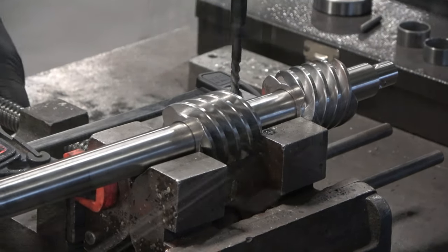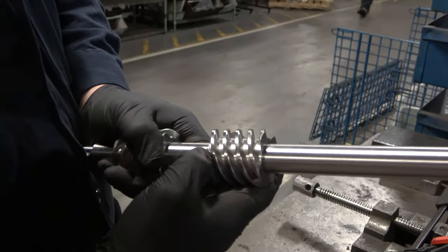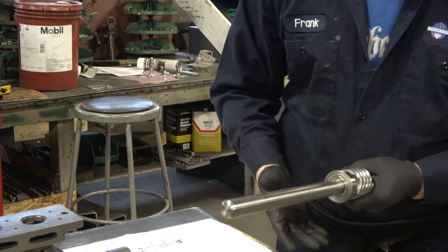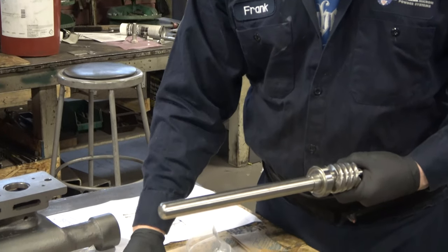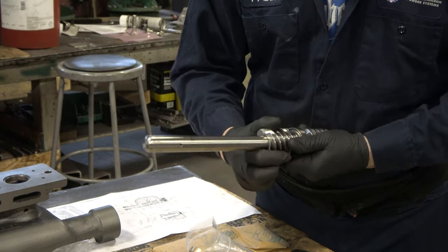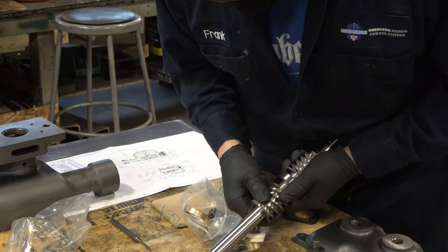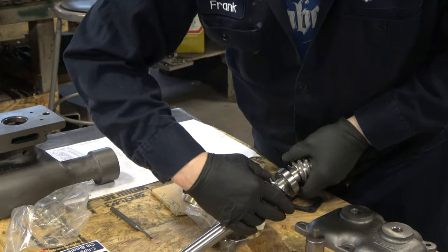It's important to go slowly and deliberately until you find the right depth for the taper. After you install the first worm gear, you install a spacer and then a bearing and then a second spacer. The purpose of these is to keep the gears at the right distance from each other so that they mesh properly with the gears on the feed screw shafts. Make sure when you put the number three taper pin in through the gear that it's in the proper orientation and that you've reamed far enough so that the taper pin is almost flush with the valley on the gear.